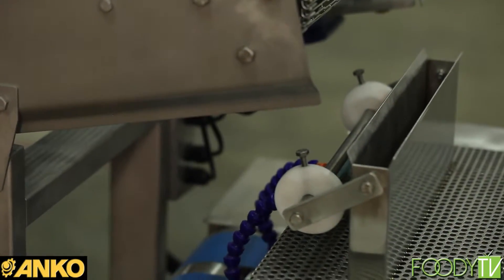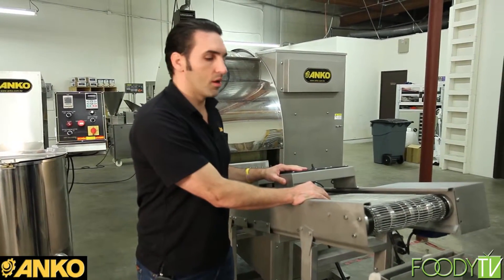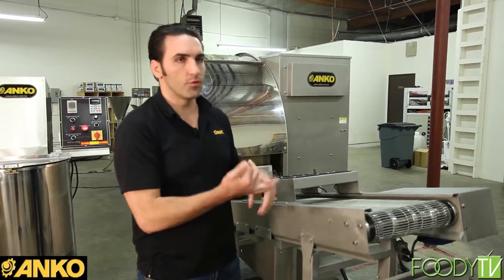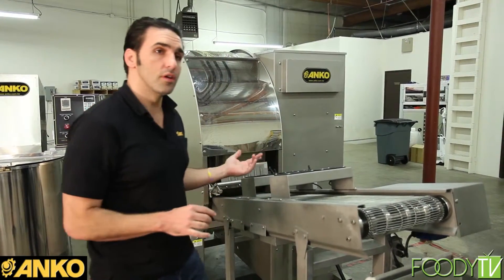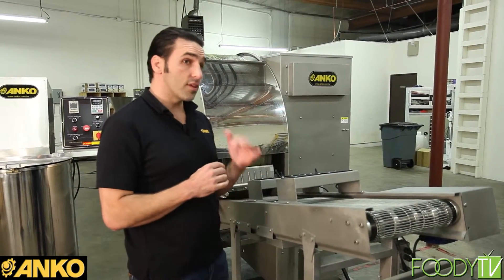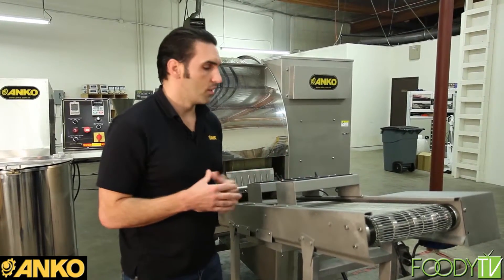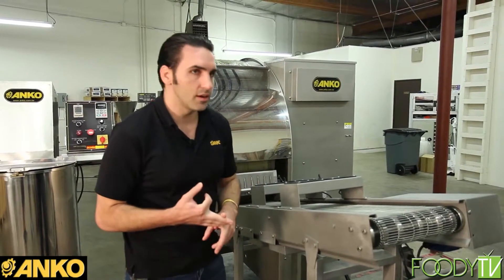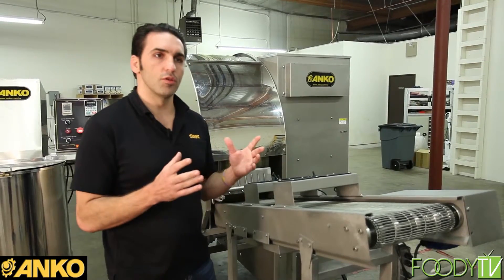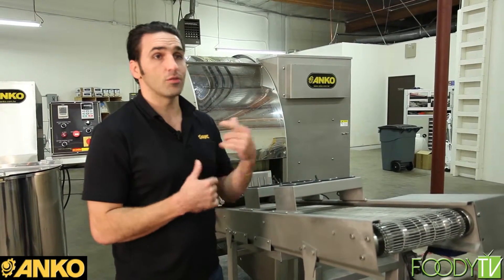The first benefit of automation is that you have your own pastry. Customers can tweak the pastry — everything on the entire machine is programmable, from the filling to the folding, including the pastry. We can coach you through different pastry recipes and different thicknesses, which affects the texture of the final spring roll. You can make it thicker, thinner, heat it more or less, and save those settings on the machine. You'll tweak it until you get exactly what you want, and then it's totally repeatable.